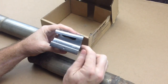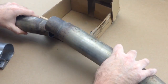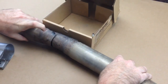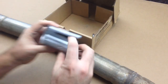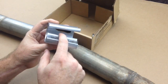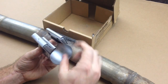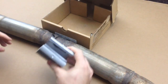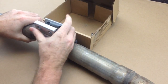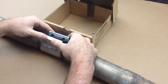It's made to cover the seam — right where the welds are — at the top of the clamp where it's not fully closed. That cover will keep you from having a small exhaust leak at the top. It'll make it a little harder to remove, but it won't be impossible.